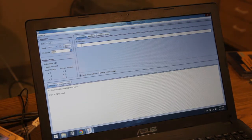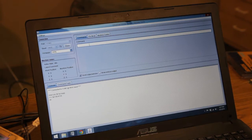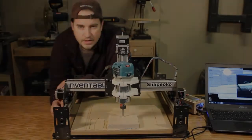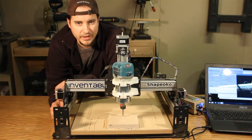On the command line, type $2 equals 94.4735. To check your settings, you can type $$ on the command line and that will display all of the settings in Grbl. Now that we have the settings in Grbl all updated, we can go ahead and run a program.